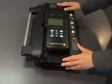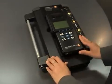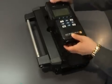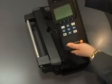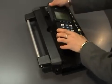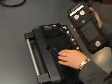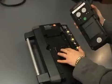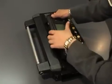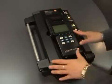The main one is the analyser box and the control unit is the small one up here. To detach the control unit, just press the slide down on the bottom left and lift the control unit up. It can operate separately as a standalone unit to measure humidity and differential pressure. To put it back on, just make sure the groove on the back of the unit sits on the slides on the analyser box and make sure you hear the click.